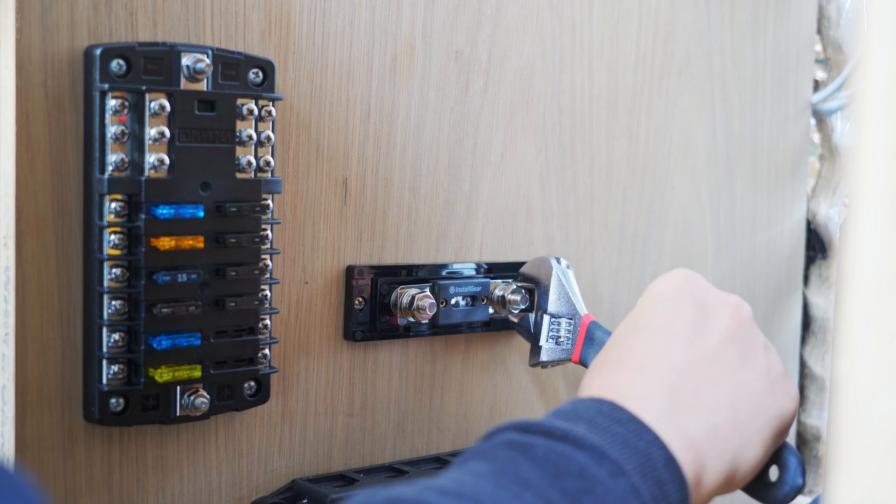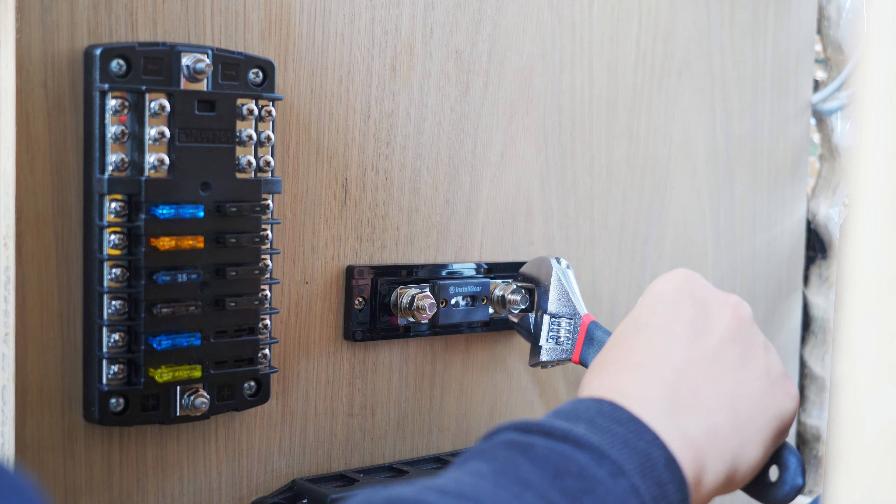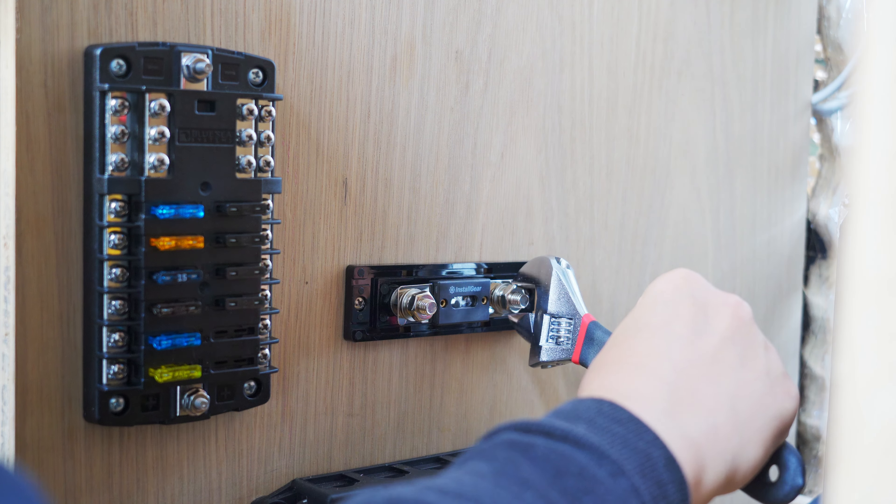For the DC block you could just buy a set of different sizes of fuses, and there are also ANL fuses — you'll need to figure out what you need for your setup. Let me show you what I mean. This is a DC fuse block — just gently removing it because there's power in there. The second one is the fridge, and the third and fourth one down is the bed. You can see how it's connected — those red wires right there. Both my bed and my fridge are using a 15-amp fuse. On the left side you can see a bunch of twos — those black fuses with 'two' on them — those are all the lights.